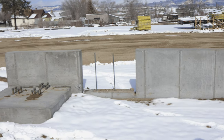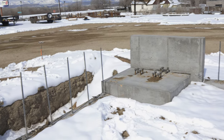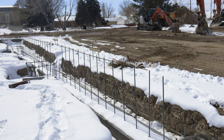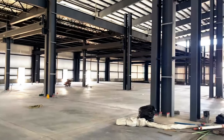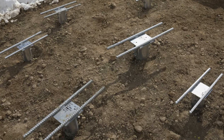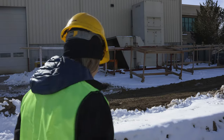In a steel building like this one, it's been engineered so the whole perimeter is still below the frost. In this case, our helical piles are not acting as frost protection, but they are acting as a compression and tension load. So we're going to look at the different locations here and the different types of footings needed with a steel building. With a steel building, you typically have a post that comes down with anchors, and ideally a helical pile is placed directly below that.